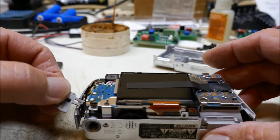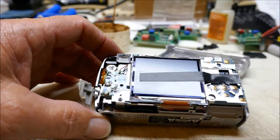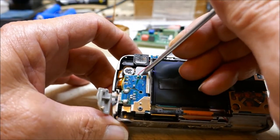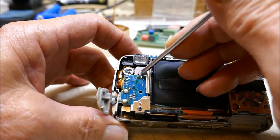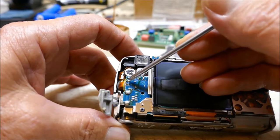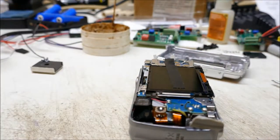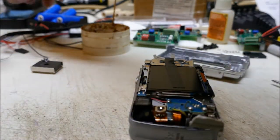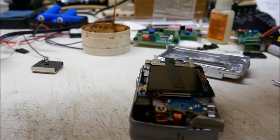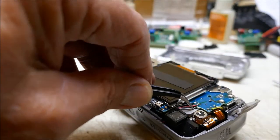Once you've got it to this point, you can either cut or desolder the wires. There's a black and a red wire that need to disconnect, and then three wires — a yellow, a gray, and a white. Go ahead and desolder all of those wires before you ever start taking your front cover off, because we won't need any of these wires anymore.